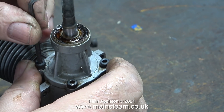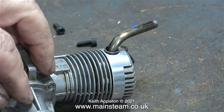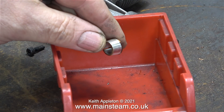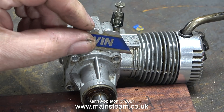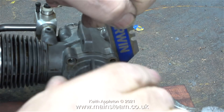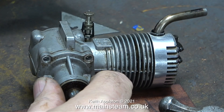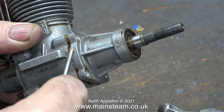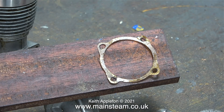The time has come to remove the front part of the crankcase. I'm going to be really careful with this because I do not want to break it. The first thing to do is to remove all four of the allen bolts that hold it in place, putting all the parts in a plastic box so I don't lose them. I need to separate the front part of the crankcase from the main crankcase. I put the front part on a piece of mahogany because I do not want to stress it during this next operation. I'm using a Stanley knife blade - hitting a Stanley knife blade with a hammer is not recommended, and you must wear eye protection and only tap it gently. Eventually the seal is broken and I can remove the front part of the crankcase. This process is very similar to removing parts from a steam engine, except the parts are less rusty. The good news is I managed to do this job without destroying the gasket.